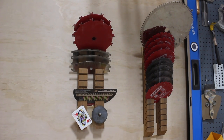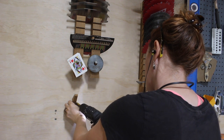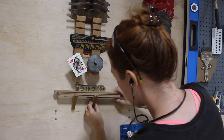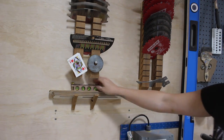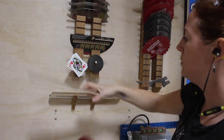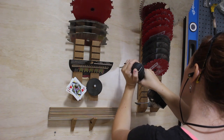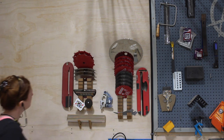Typically whenever I'm using a dado stack, I use whatever is recommended on the cheat sheet plus one card. Right underneath the dado stack I added two triangles cut from scrap wood with a few pocket holes, angled slightly so they tilt up to hold my insert plates. These go to the new insert plate I'm using in my saw — instead of the entire insert being disposable, they made a removable portion on the inside. Anytime I cut into a new insert I mark what blade thickness it was for, and this shelf can hold all of the marked ones as well as my blank ones. For things like my spare brake cartridge and the insert plates that came with my saw, I just threw a screw into the wall and hung them.